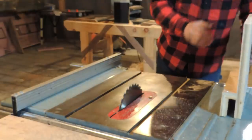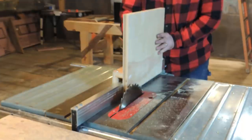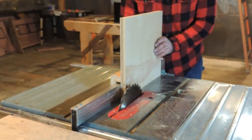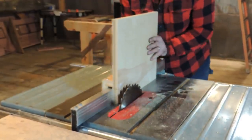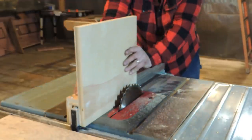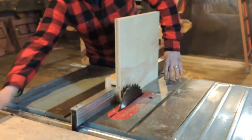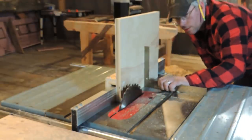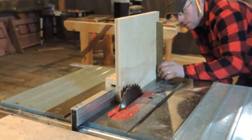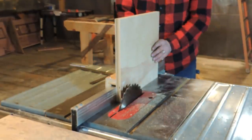It is nice and square - I'll take that all day long. I'm not quite satisfied yet. I know it sits nice, but I want to make sure that we're going to run nice on this thing - on the fence. I'll run it back and forth, it clears all the screws, it gets all that nice. It's nice and tight, it's not wobbling all over the place. So I want to check it again for square now that we're sitting on the fence. Beautiful - and check it both ways, check it along. Not too bad.